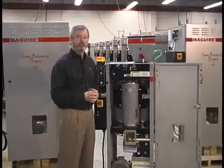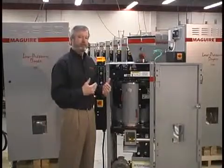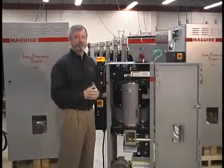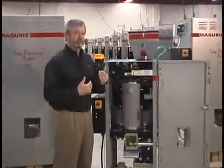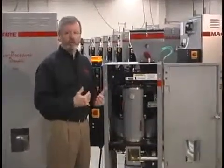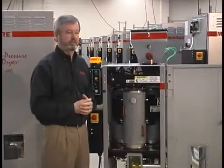Okay, let me do a quick summary of the benefits of vacuum drying. First of all, 70 to 80% less energy consumption because we don't have desiccant to regenerate. Secondly, since we dry 6 times faster than a desiccant dryer, that speed is very important in how it can influence your productivity in your processing facility.